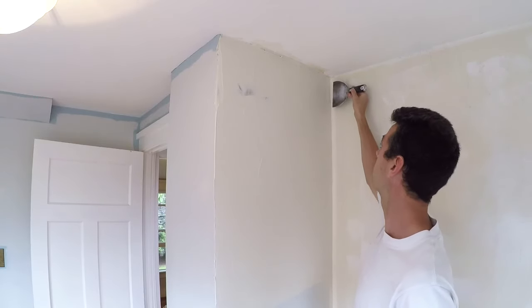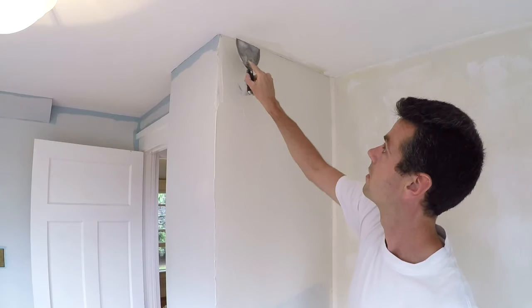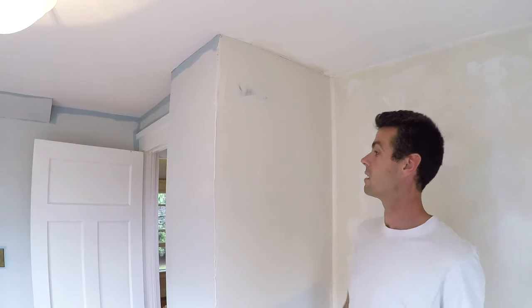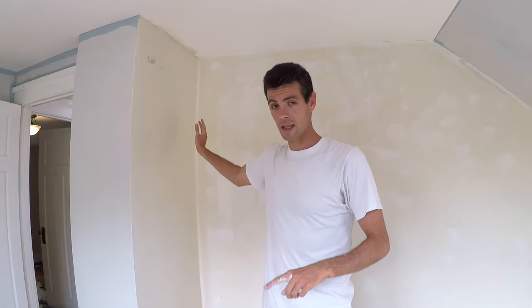That's good enough — needs a little knife work at the top. I can live with that. The mud's all nice and smooth without any major bubbles or pinholes, so it's going to sand really uniformly. There are some lift-offs and spots more than others — you can see that high spot — but generally it's all really smooth and it's going to sand out in just the one coat. Well, there's one method you can use to make sure that your quick set drywall mud sticks to the plaster and you have a hard, durable, long-lasting finish underneath the cheap crumbly drywall mud. Anyways, thanks for watching Vancouver Carpenter — hope you guys got something out of this video.